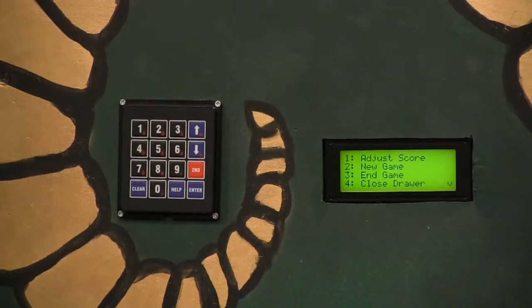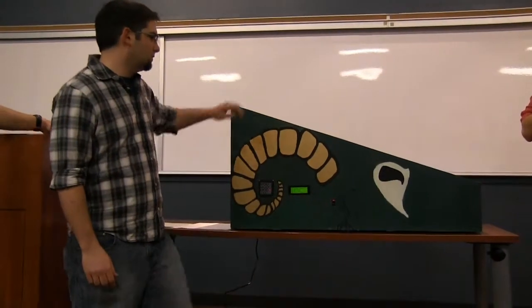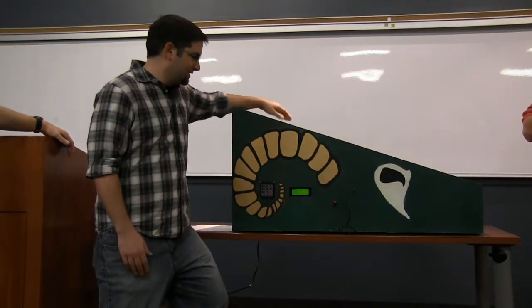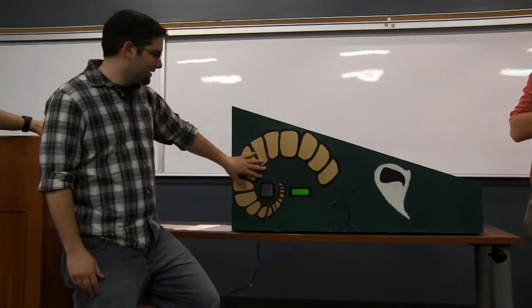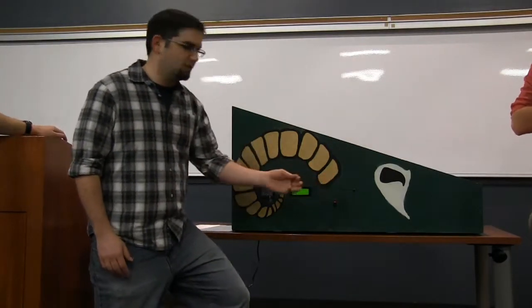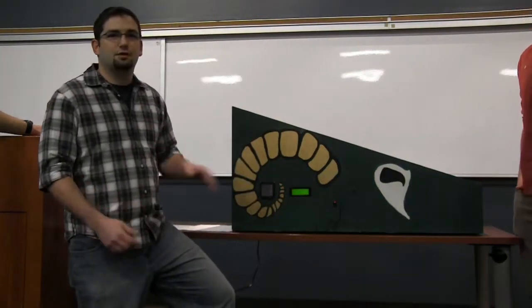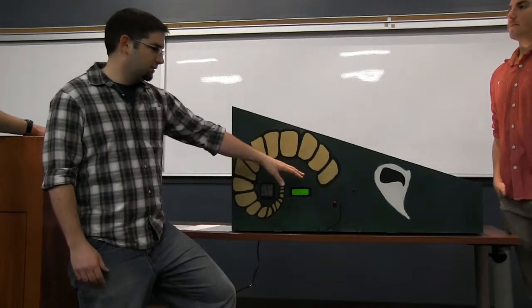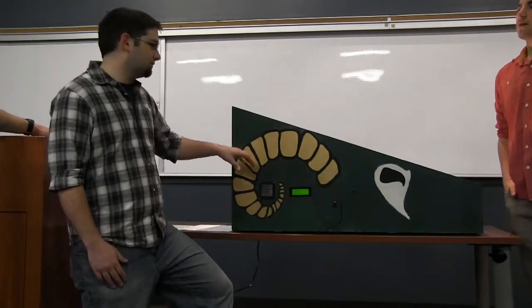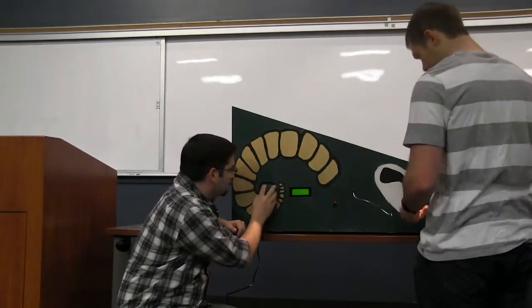For the audio circuits, we have two front speakers. We have a file that plays when the three-point trigger is tripped, and that is tied into the audio circuit for the iPod or phone or any kind of external source. As soon as you make it through the three-point hole, if the audio is playing through the iPod or phone, it'll shut off the audio circuit, play the sound for the three-point hole, and then turn the audio circuit back on. So let's turn on the audio for the iPod.